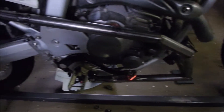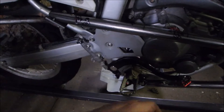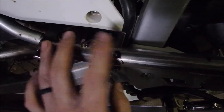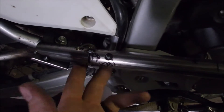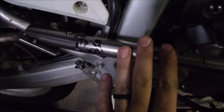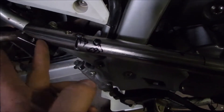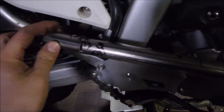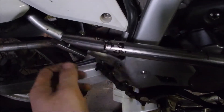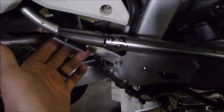So this is the subframe brace as I have it at the moment. You'll notice back here there's a little bit more going on. I drilled these holes to do four plug welds. I'm going to weld down the middle also because I didn't get this angle right — I had to cut this and rotate the end, so I'm going to slug and plug that so it's strong when this all goes back together.